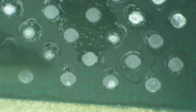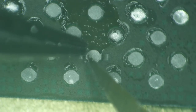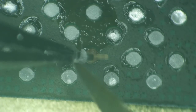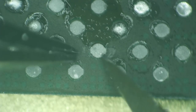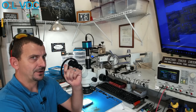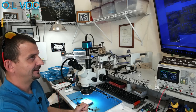And this NAND is the reason why I went up on temperature for the CPU. But as you can see, this has been raised up off of here like this. And by the looks of it, that's going to be a not connected pad. But I am going to look at that quite a bit closer before moving on. But honestly, it's still functional the way that it is, as long as I remember that it's messed up and don't just crack off the board with my wick.